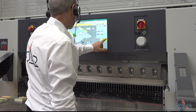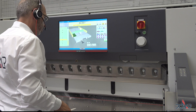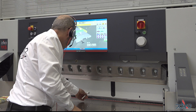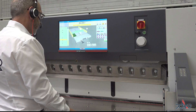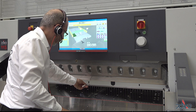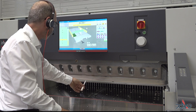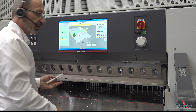That's not very difficult. Normally, most operators will bring the clamp down with the foot pedal a little bit, then go with a pen or screwdriver into these plastic pieces to get it out of the clamping bar. That's very dangerous because if I'm not holding the foot pedal very precisely, I end up crashing my screwdriver or pen into the knife. And if this is a carbide-tipped knife, that's very expensive.